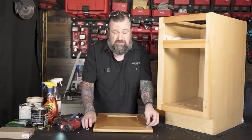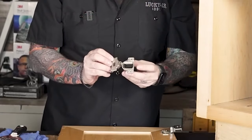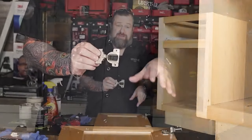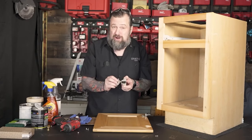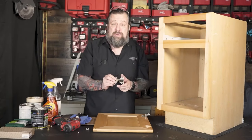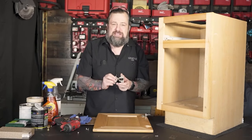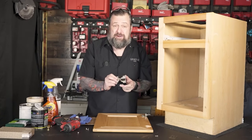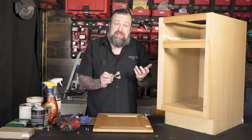At this point, you want to figure out if you're going to upgrade hinges. These actually are a Blum hinge, which are pretty high quality. If you dive into this type of cabinet and want to get into hinges, your best bet is to go down to your local specialty hardware store, not your home improvement store. Take those down there and try to match them up because there's literally hundreds to thousands of options — it's a deep rabbit hole. So lean on a pro if you're going to tackle the hinges. You might be able to upgrade them to soft close, depending on what you're looking for.